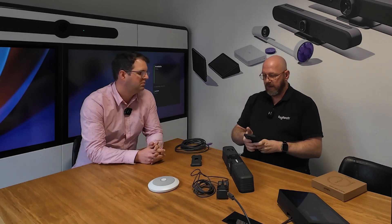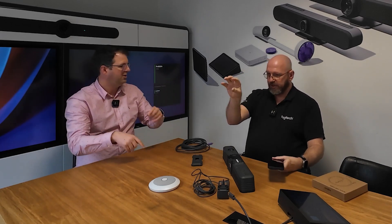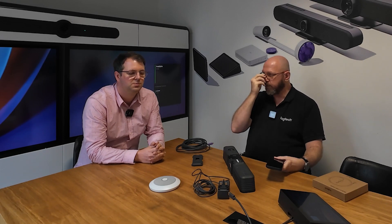Once you've got all that and it's powered up, the out-of-the-box experience can start. A couple of ways to do it. The best and easiest way, if you're running ethernet, it's going to be connected to the network and you can press a couple of buttons to enable something called Local Network Access, or LNA. LNA is a web UI running on the device, and you can connect your laptop and go to the IP address. It drives a screen, so it will tell you the IP address, the username, and the password. The default password is just the last six of the serial number. It will also tell you that you have to change the LNA password within 48 hours, or LNA will be disabled — that's a security feature.